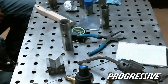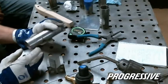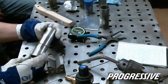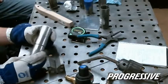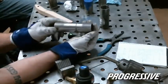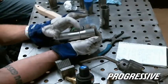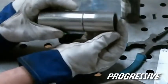And again, you're hanging there to cool the tungsten down and to purge that weld up. So that'll help cool the weld to a point that it's not molten anymore and able to bring in oxygen. So I don't know if you can see that. Can you see this? So it's minor, but the amount of gap here compared to this touching, just from the pool of one tack.